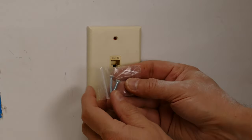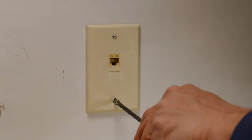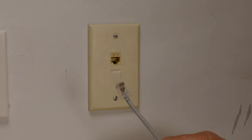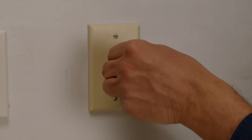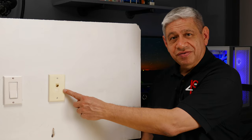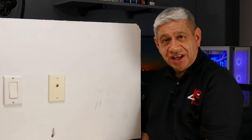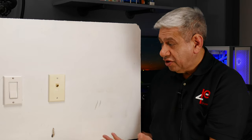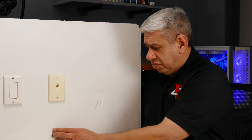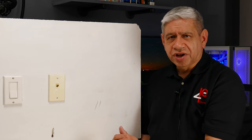I have two screws that came with it, and now it's locked into place. If I have a cable that I want to connect, I'll plug it right in and we have a connection. Everything's complete — I've got my RJ45 network connector on the wall, directly aligned with the existing switch. The only thing left to do is fix the small hole I caused: get some joint compound, push it in, seal it up. It may take two or three coats to get it done right, but it'll work out very well.